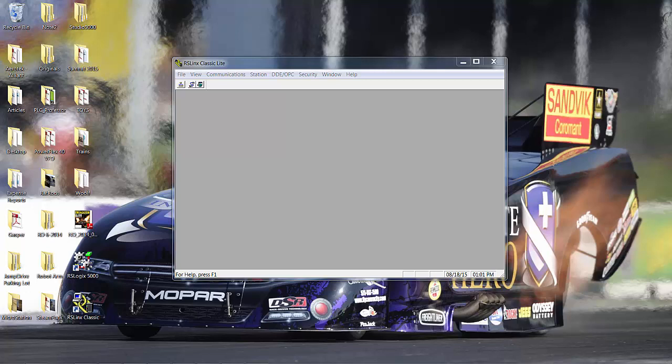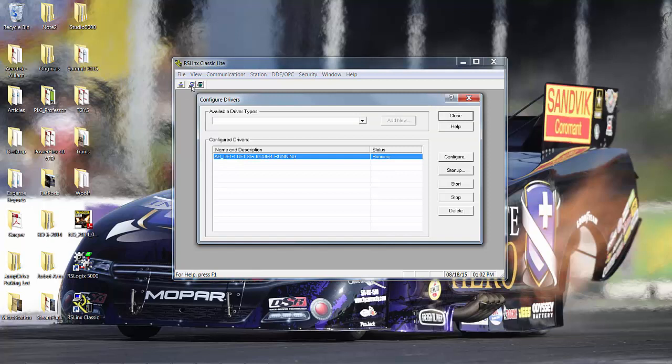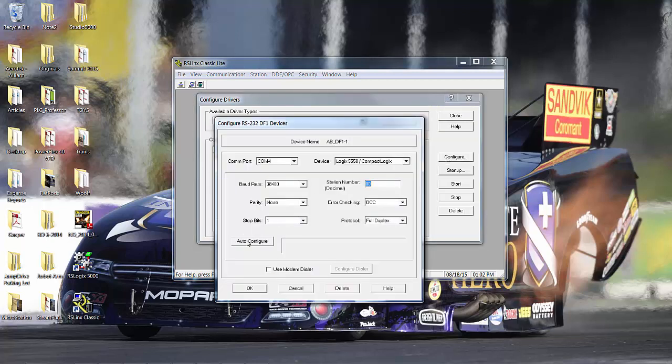In our last video, we were connected to an L31 processor that has two RS-232 ports, no Ethernet. In the manual, I did vary the processor when I was showing the addition of different I/O other than the IQ6XOW4. What I've done here is I'm now connected up to a different processor, and we're in RSLinx. Go here and do an auto configure. Now I'm plugged into the RS-232 port on an L35E. Hit auto configure and it was already set at 38.4.